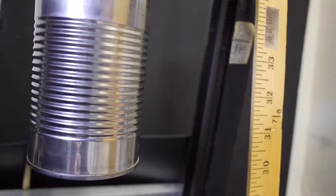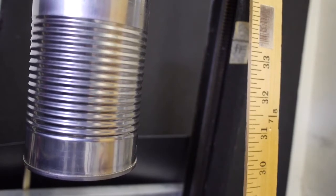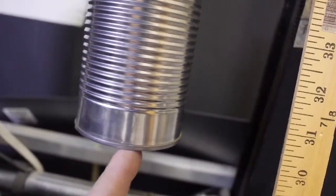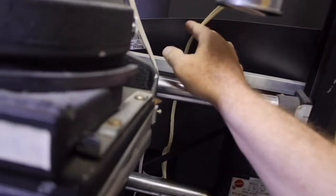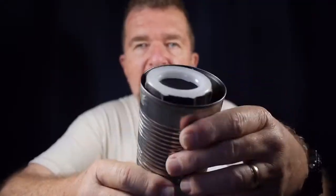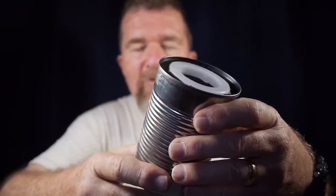There's my light, 30 inches above the work surface — the fixed distance I use. The distance from your work surface to the light source and the size of the opening will determine the intensity of the light. For the exposure time, the cord to my pre-flash light source is plugged into my Graylab darkroom timer. I'd like to make a better light source that doesn't use a metal can as a housing, so it's a little bit safer. So I went to the hardware store today and got a bag of goodies.